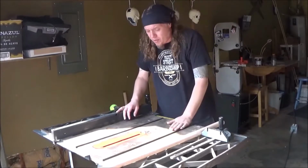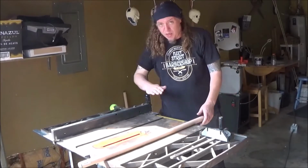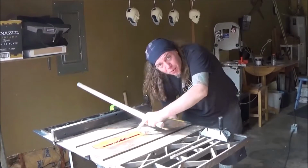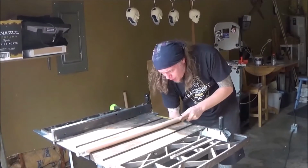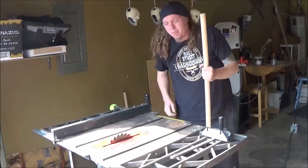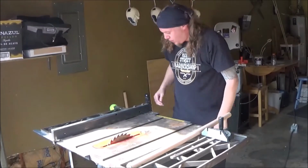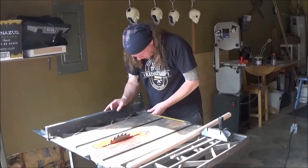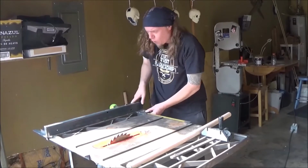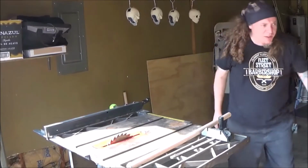All right, so what I have here is a 10-inch blade table saw. First thing you want to do, since it has an adjustable blade height, reach down in here. We just want to make sure that we raise this blade high enough that it's going to clear whatever I'm cutting. So, perfect, we're above the blade. Now, I said it before, I don't trust things. So I do have a ruler scale on here. It says we can mark it at 15 1/4.